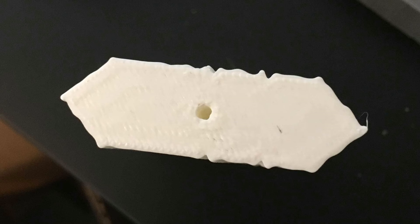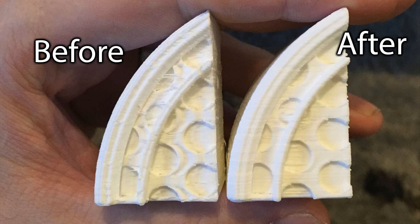There is a problem that I did encounter when printing this — it's called a Y wobble. What a Y wobble is, is when the printer's Y axis moves forward and backwards. When it does stop, if the belt is not tight enough, it kind of wobbles while the printer is moving, and this gives a wavy pattern. As you can see in these images, those edges are supposed to be straight and they ended up wobbling. To fix this error, I 3D printed a belt tensioner. I will show you that in a future video where I'll show you how you can use 3D printing to replace household items and fix simple little things that could end up costing you a lot more.